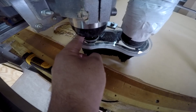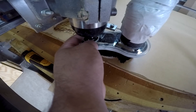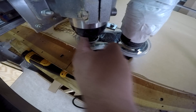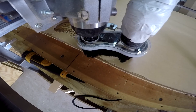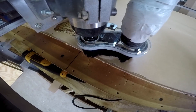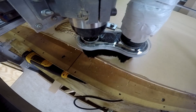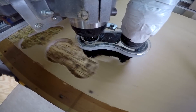I'm just turning the nut on the spindle to make sure it runs free before it actually touches the material. We're working with half-inch acrylic — a 4x8 sheet, but just using a portion that's already been cut. We're trying to maximize our material by zeroing the machine right at the very end of the last cut, then verifying that the whole file will be cut on material and not away from it.